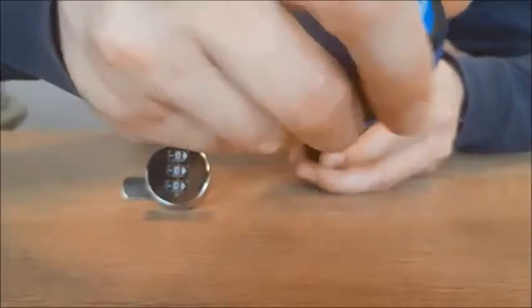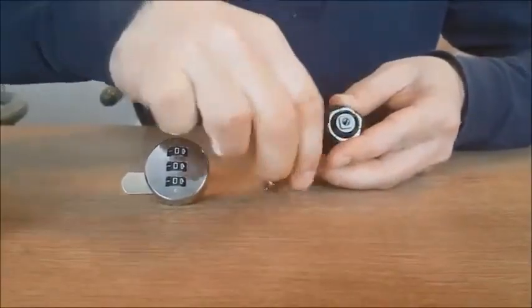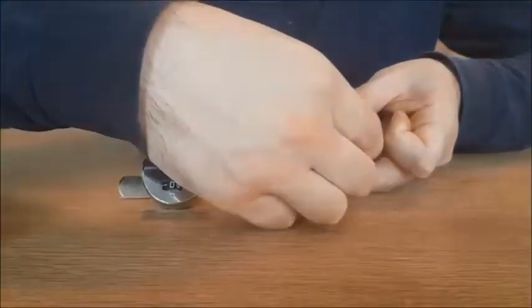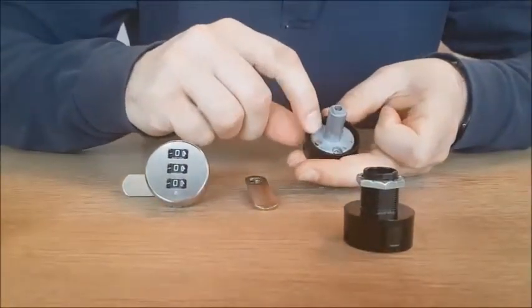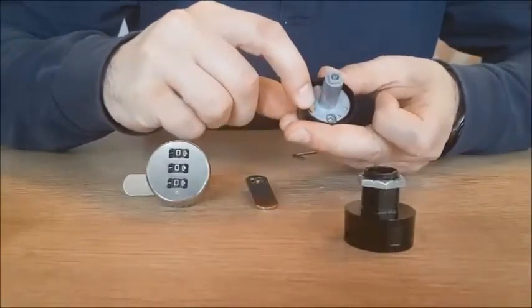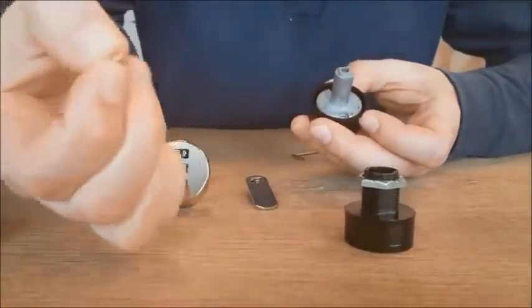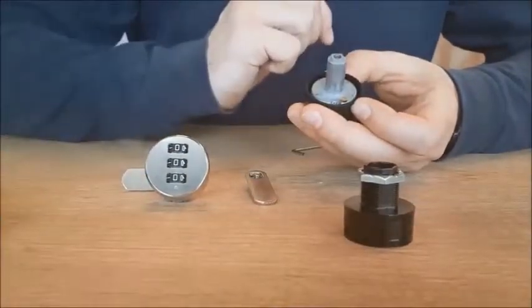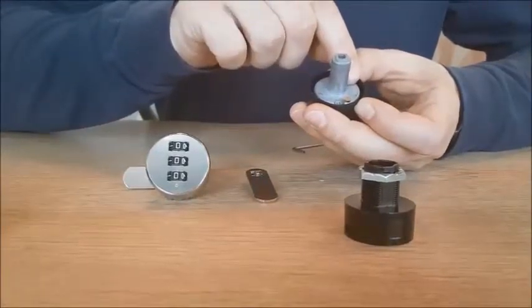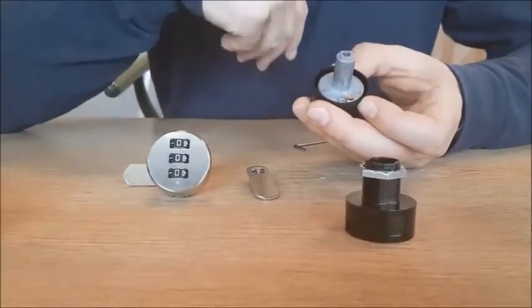It's very simple: you turn the lock to take off the cam, then take off this part, and here you will see a small brass knob. Next to it, it says R for right — so this is the right hand lock. If you want to convert it to a left hand lock, you just take out this small pin and put it in the other hole. Or if you want a lock which can turn 180 degrees, you put it in the third hole over here.